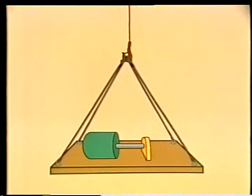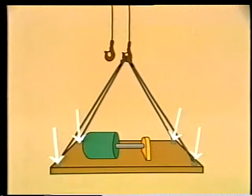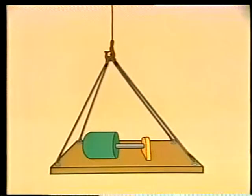The balance of the load is the second piece of information that helps you select your equipment. Some loads are fairly easy. If they're balanced, all you have to do is lift from the middle. Other loads can be more complicated. This load, for example, is unbalanced. Its center of gravity is here. To lift it safely, the load hook has to be directly overhead, but the eyes are in these 4 corners. We'll need a 4-legged sling with 2 short legs to move the load hook directly over the center of gravity. When the load's picked up this way, it won't tilt or shift. It's balanced.